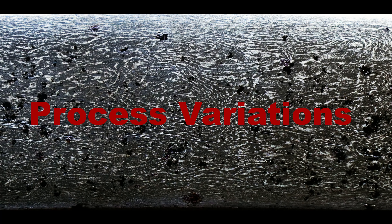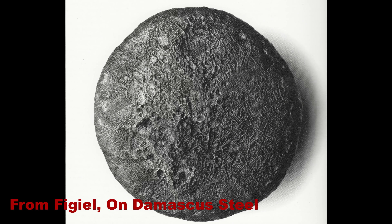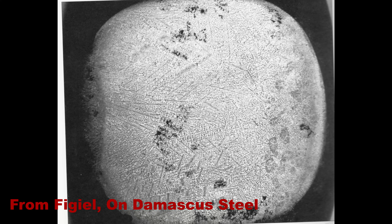The crucibles were heated for anywhere between six hours, as in the South Indian process, to around two days in the Dakani process, or as many as six days in the Isfahan process. Wootz buttons present two distinct regions on their surface, with the top of the button having a rough appearance and often being used to form the spine of weapons, and the bottom having a finer texture, often used for the edge. On both surfaces, a fine network of dendritic fibers is visible, indicative of the heterogeneous crystalline structure of wootz. If a crucible charge failed to show good patterns after window polishing, they were sometimes subjected to further heating. In the Isfahan process, the wootz ingots were taken from their crucibles after firing and placed in a heated room for two days in order to temper them and relieve stresses prior to forging.